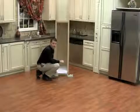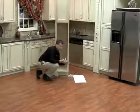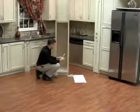Now that we've pre-drilled our pilot holes, let's go ahead and remove our template. And you're going to grab 2 of your snap toggles, and we'll insert these into the 1/2-inch holes that we have drilled in the back. And then you will gently move down your snap plug and simply bend the plastic posts back and forth until they snap off.